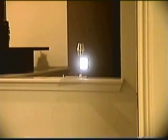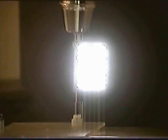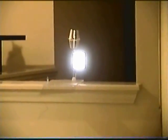Okay, here's the latest version of the OneWire — or wireless, depending on who wants to define it. I have 48 super white LEDs. The breakdown of each LED is 3.1 volts, running at 22.5 milliamps. They're all hooked in series. You can multiply 48 by the voltage and you'll know what I have available here.